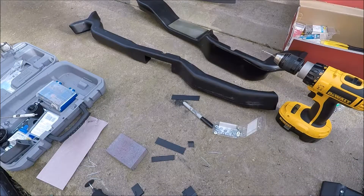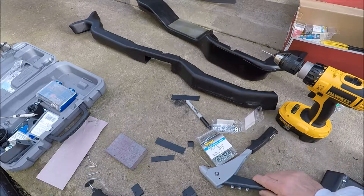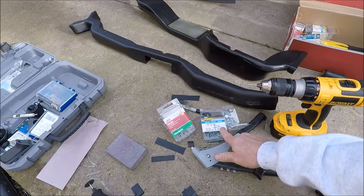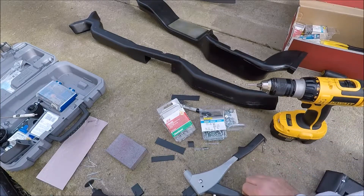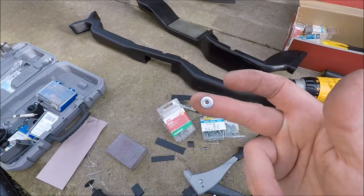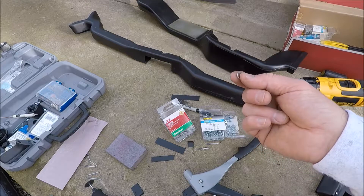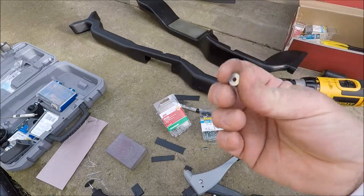A note about pop rivets. Anytime you are using a pop rivet gun, pop rivets are awesome — they pull material together as you're doing it. They come in stainless steel, aluminum, and steel rivets in different lengths and different diameters. The key is to use the proper drill bit for the proper diameter rivet. I'm using 1/8 inch rivets, so I'm using a 1/8 inch drill bit for my holes. Anytime you're doing soft material like plastics, the rivet will actually pull right out through the secondary piece, so you have to use a backing washer in the rivet section. Metal typically doesn't need one, but if you're using some really soft aluminum it's also a good idea.